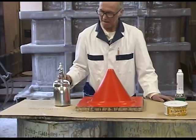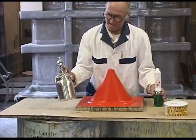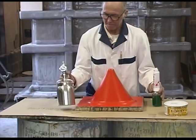Rayplex offers two applicators for putting PVA on. One is a commercial spray gun that Bernie has there. These are relatively low cost. We've actually found them to be better because it saves on the maintenance cost of rebuilding a gun. These things are so inexpensive that you can basically throw them away when they need servicing. That's the way the world seems to be going today.